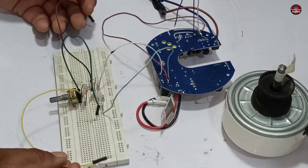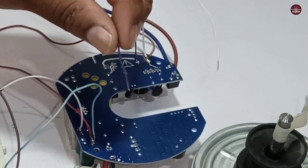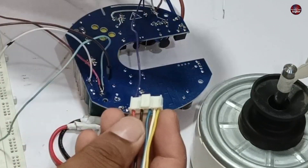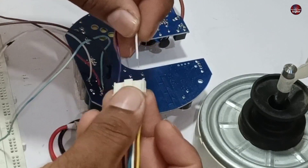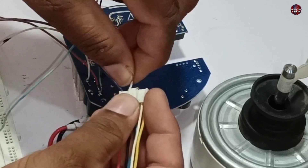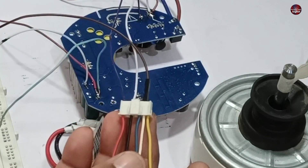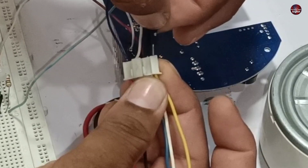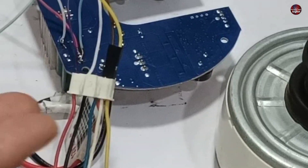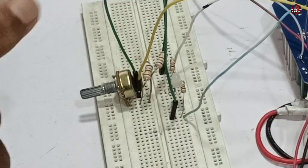Four connections for the blower motor are now ready: the VSP voltages, the 15 volts, the ground wire, and the 320 volts. I am connecting the purple wire to the red wire of the motor, which is 320 DC volts. The white wire connects to the black wire, which is ground. This brown wire connects to the white wire in the connector, which is the 15 DC volts. The yellow wire — the operational VSP voltage — connects to the yellow wire on the connector. I can now operate and run the motor without the feedback wire. Let me show you by running it.